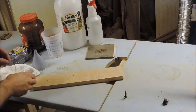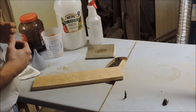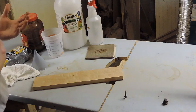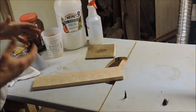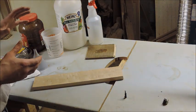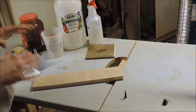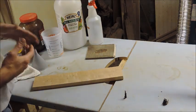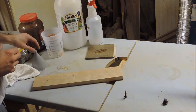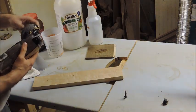Okay, so to start off, I think what we'll do is look at what I'll be doing to the legs of this table, which is to treat it with that compound called iron acetate. I think the cool thing about this project is that it has supplies that you probably already have around your house. I'll start off with this because it doesn't involve a blowtorch, and not everyone has a blowtorch around their house. And the reality is that you could treat the tabletop in the same method as you're treating the legs here. It's just household ingredients: vinegar, steel wool, something people usually have around.